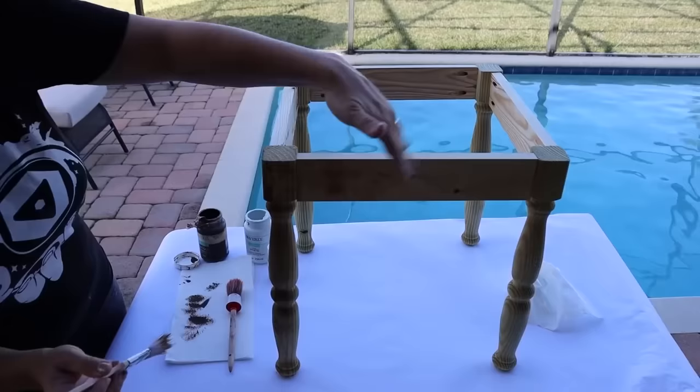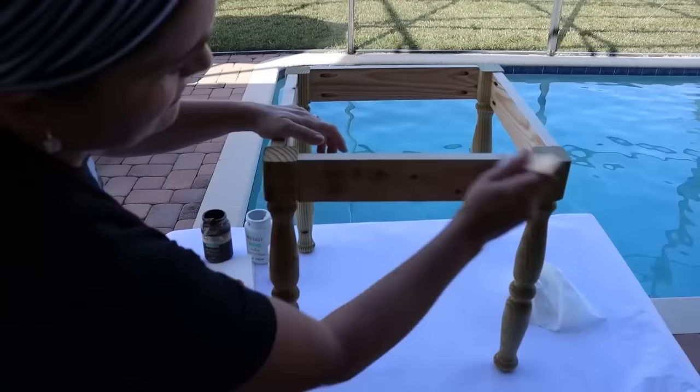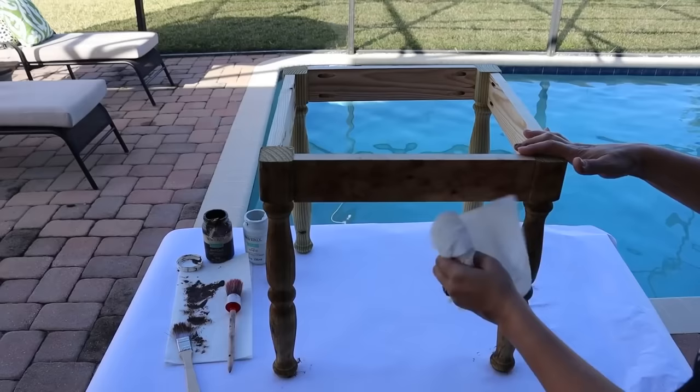randomly. And this is gonna put some age on it. Make it look a little dirty, a little less new, and make these two mismatched woods blend together. I also have some matte mineral paint to add some gray if we feel like we need it. And then after you have it how you like it, I go back with a very lightly damp paper towel, hardly any water, and just feather it out a touch in case there's any harsh areas.